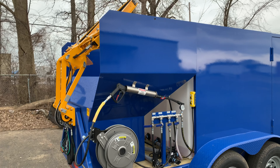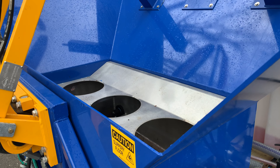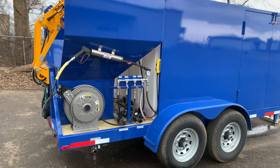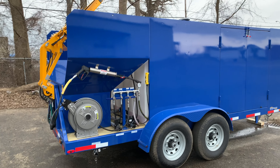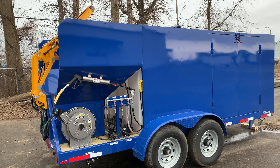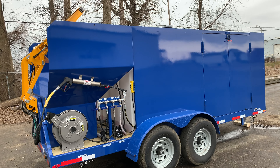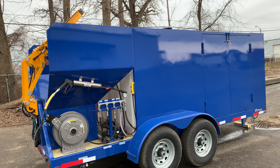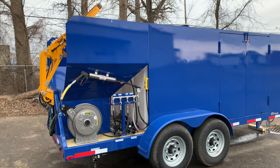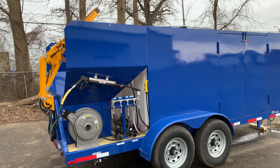These are open-top hoppers, and with our filters removed, water could spew out the back if you hit the brakes, accelerate too quickly, or make a sharp right-hand turn. If you're spewing out unfiltered wastewater that contains oil, grease, and phosphates from fertilizer, that can cause algae blooms — including the blue-green algae spreading across the country that is killing dogs that swim or drink from lakes or rivers.